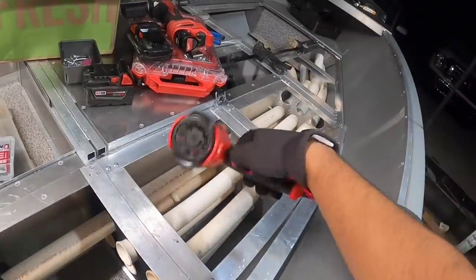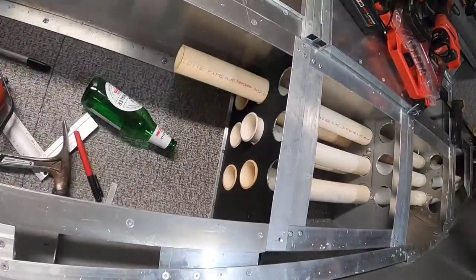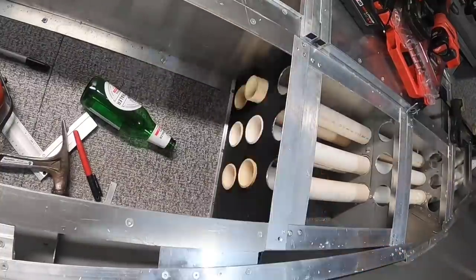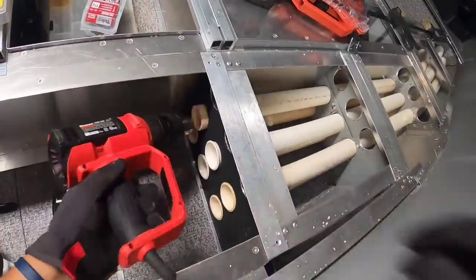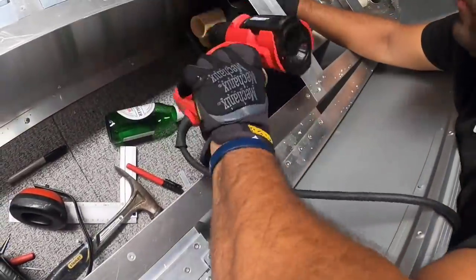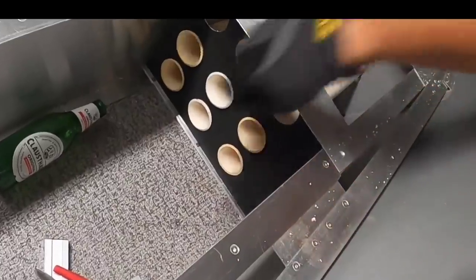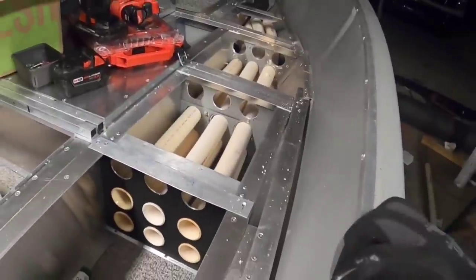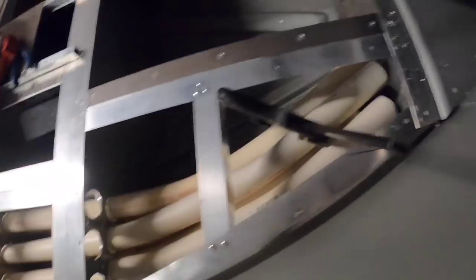It's recommended that you wear gloves because otherwise you're not going to be able to handle the tube and move it through the pieces — it's a pretty tight fit. We're only tapering it to the very end, just making sure it's going to stay, and then readjusting as needed. The third row is more of the same: keeping the tubes as straight as possible until we absolutely have to bend it.